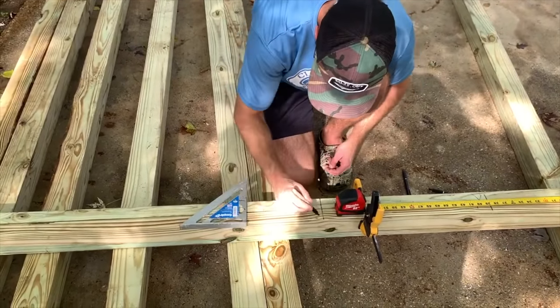And in my case, I had to excavate a little bit in order to get the ledger board to sit flush against the shed base frame. And this is why building a shed ramp is nice, because you can excavate and make tweaks to make everything work. After getting it excavated properly, getting it flush, I then compacted the soil with a 4x4. Then I performed one final dry fit to make sure the ledger board was fitting perfectly flush against the shed base frame, which it was.